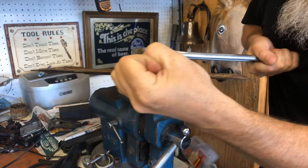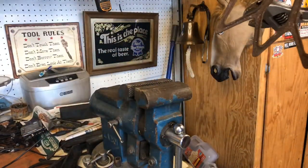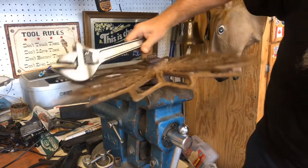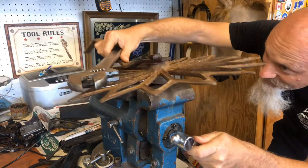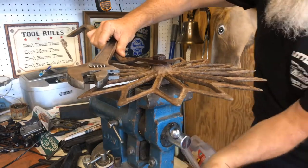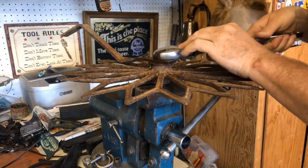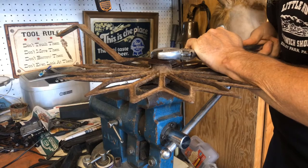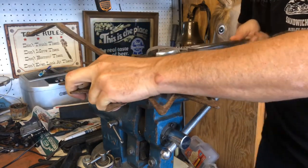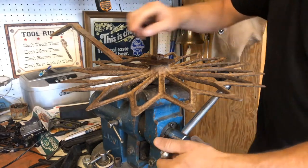This one's rounding off. Let's try it in a different position — who knows, I might have to just grind this off and punch it out. That's pretty well mangled at this point. These are probably cast iron here so I'm trying to be very careful with them. It's just gonna break again. Okay, so that one doesn't appear to want to cooperate. We'll set it aside and think about it — we might put some heat on it.